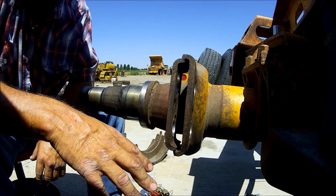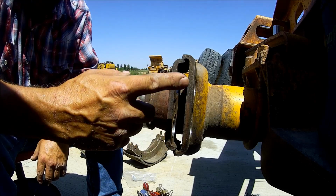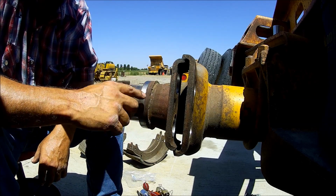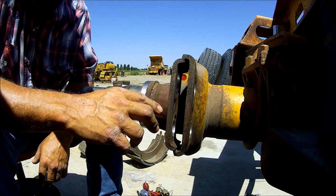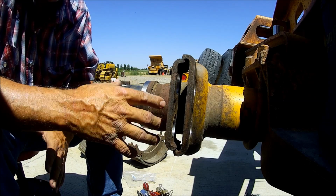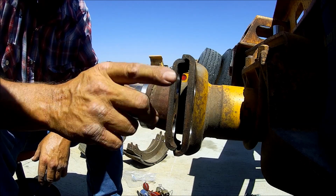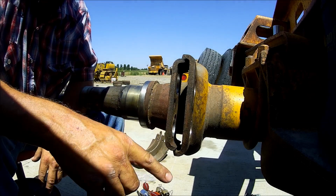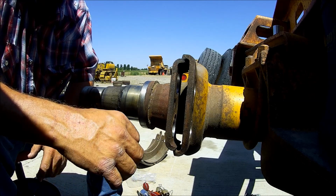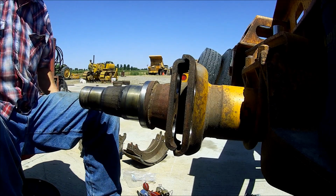So I limped through the stoplight, went clear up under the overpasses, across the Snake River, and turned onto Highway 39 where it was 4 lanes, and I got over. And what had happened is all the lug nuts had come loose. Okay, they didn't undo the lug nuts. They took the whole wheel and hub and everything off. Because they put left-hand threads on the right side, they jiggled loose, and that's why Budd wheels use right and left-hand threads, so that your wheels don't come loose.